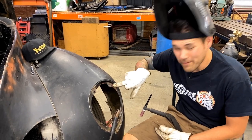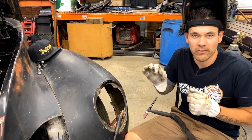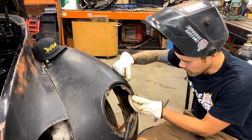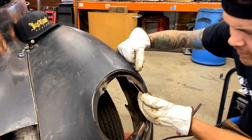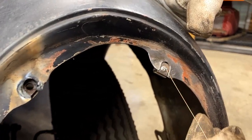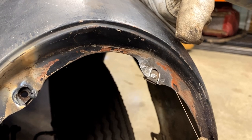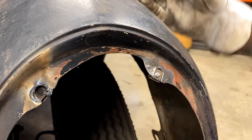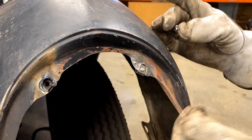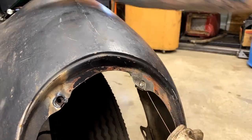For something that's quite flush, the beauty of a TIG welder is that you can very precisely dab on metal, keep the amperage low, and it's easier to control. What I'm going to do is slowly build this up as if it were a stud — put material on the end until it comes up maybe three-sixteenths or a quarter of an inch, so I have a stud I can slip the nut over top of. I'm using a slightly bigger nut with a 5/16 hole. Building the stud out puts a lot of heat in there to loosen it up, then I'll weld the nut right on top.